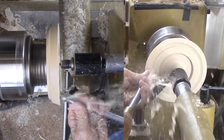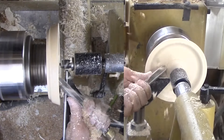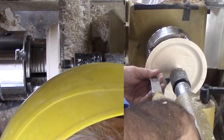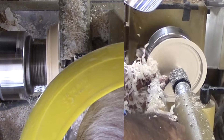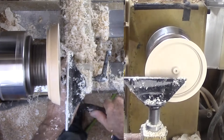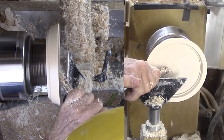The live center will provide security while I start the hollowing process. There's not a lot of wood to remove so it goes quickly with the bowl gouge. Then remove the live center and smooth out the center with a box scraper. The center will accommodate the puzzle, so that portion is squared off to about the depth that the puzzle will need. I am particularly careful to thin down the bottom without cutting through it — multiple measures to be sure.